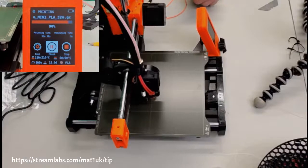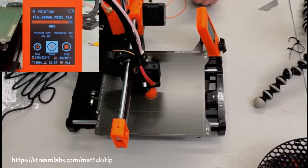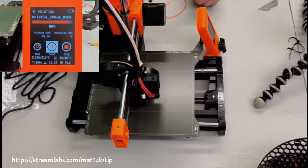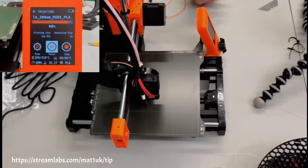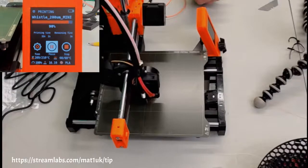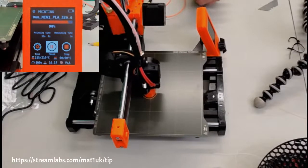There are going to have to be little things you have to tune. It's a highly accurate machine when used properly. So the room for mistakes and errors is massive. Absolutely massive. I mean, it's inconceivable, really, when I first got a 3D printer, in my brain, that I'm printing layers at 0.2 of a millimeter each. So I've got to print 5 layers to do a millimeter of height. And that absolutely blew my mind.